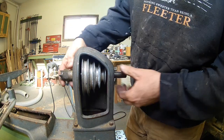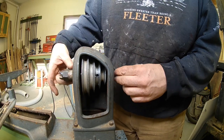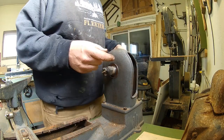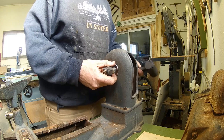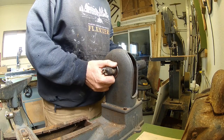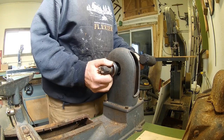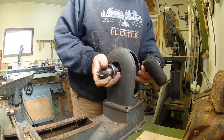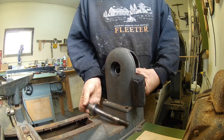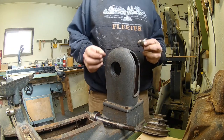This is where it gets a little nerve-wracking — not everybody wants to hit these things. This bearing just presses into the housing; it's a slip fit on the shaft. If you hit it with a soft hammer you won't hurt the threads. Hang on to it so it doesn't rattle too bad, and hit it as flat as you can. The pulley will stay inside the housing — that's your shaft with the keyway — and the pulley just comes out in your hands with the belt still on it.